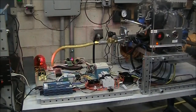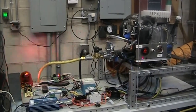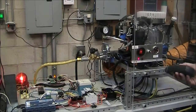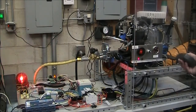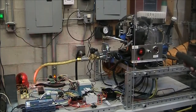Just to show you again, we'll attempt to start it — that is, we're going to drive the BLDC motor, then we'll turn the ignition on to the engine. The engine will attempt to start and run autonomously. It looks like the BLDC motor will prevent that from going to full RPM. At that point, Chris will disconnect the relay, and you'll see what happens to the engine — its speed will go to its normal operating speed.